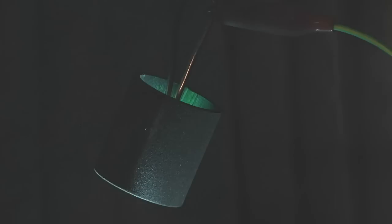Very nice so far. Now my box has a little handle, a little copper wire that comes up to the top, so I can easily turn the part around. There, and that part is coated. And I'm going to bake these two parts at the same time, so I'm going to get the second part set up to coat before we put them both in the oven. Now we're set up basically to get the second part powder coated.